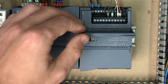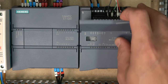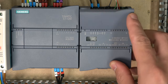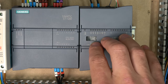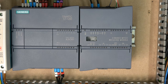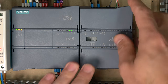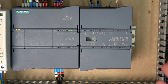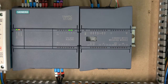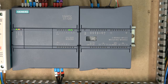Let's power it up - I'll quickly show you a couple of errors. If the load cell is not connected, you will get the error code 'under voltage'. If you see under voltage flashing and you're wondering what the error is, it's to do with your load cell not being connected. Also, even though I have 24 volts going in, the controller is completely dead. That's because the switch is set to PLC mode but no PLC is connected - it won't turn on unless it sees the PLC.